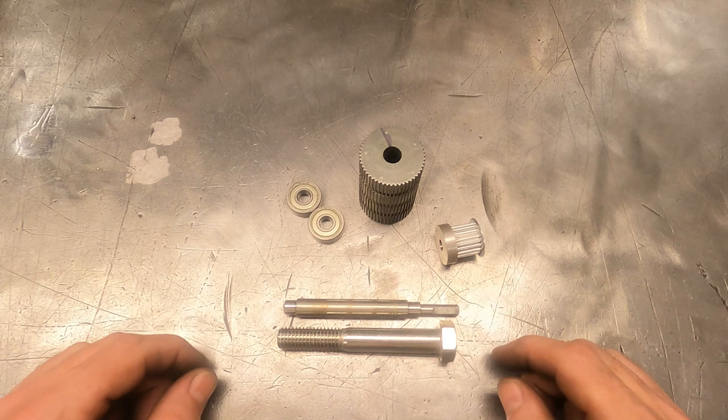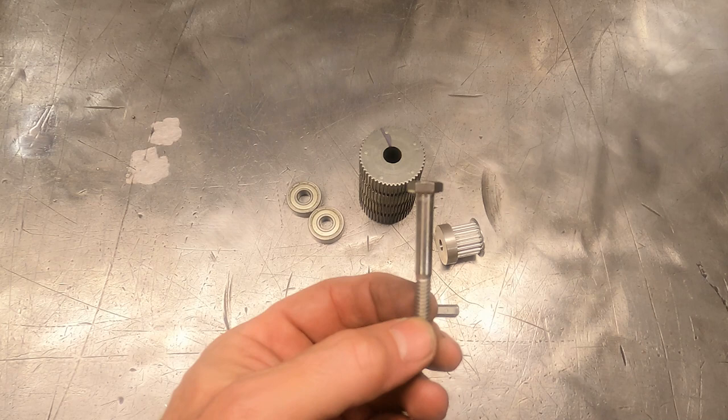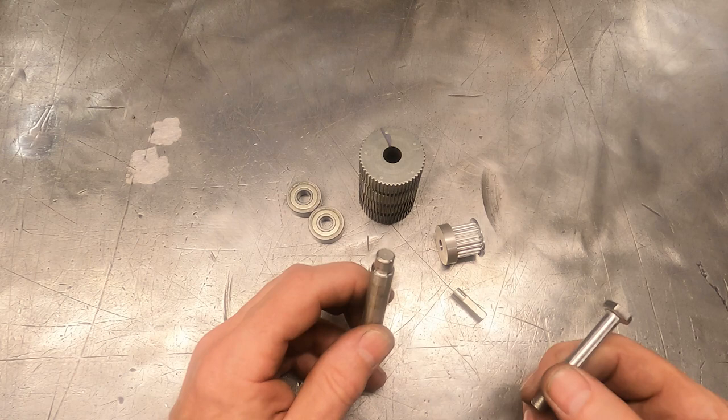We've got a few other options. There's a smaller diameter stainless bolt - a quarter-inch bolt - and importantly, this is a quarter-inch shaft. So we're going to drill and tap the shaft, thread the bolt in with some Loctite, and go to town. That will get us back moving. I don't know how long it'll last - there's another motor on order. Let's get over to the lathe and set up for drilling and tapping.